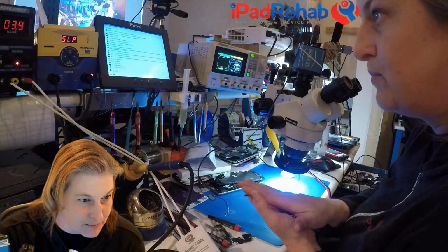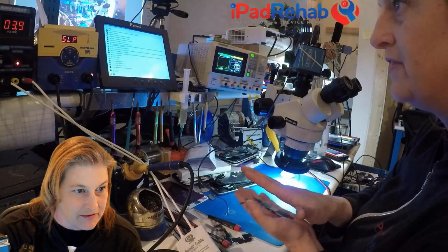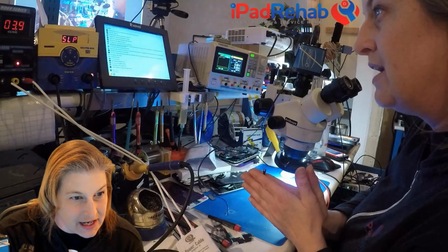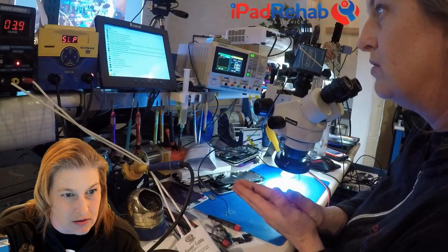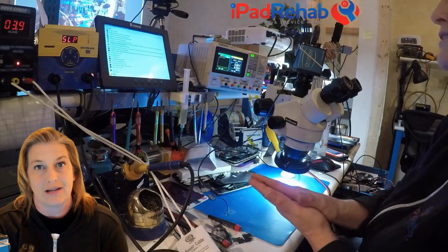I thought she said blurp cam. Capacitor by PMIC. Hand warmer, perfect, yes. The red spot is just a reflection. I fixed one before, almost the same. When I push a little on the power chip, PMIC, phone boots normal. But you have heat, maybe any capacitor short. Yep, so we've got a short somewhere. We know we have a short, that's all we know.